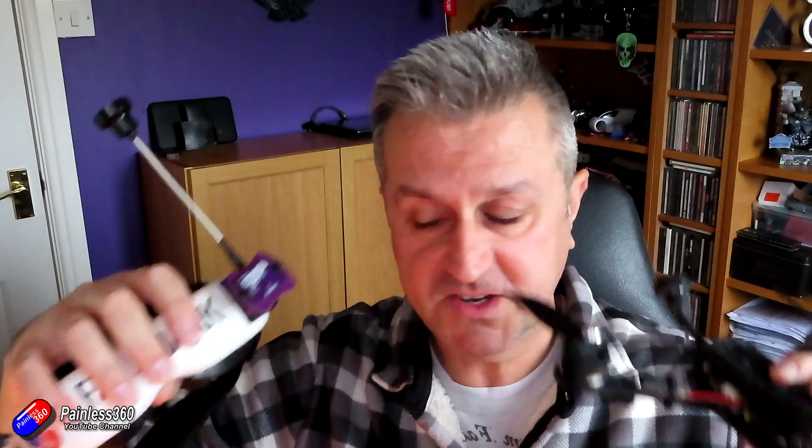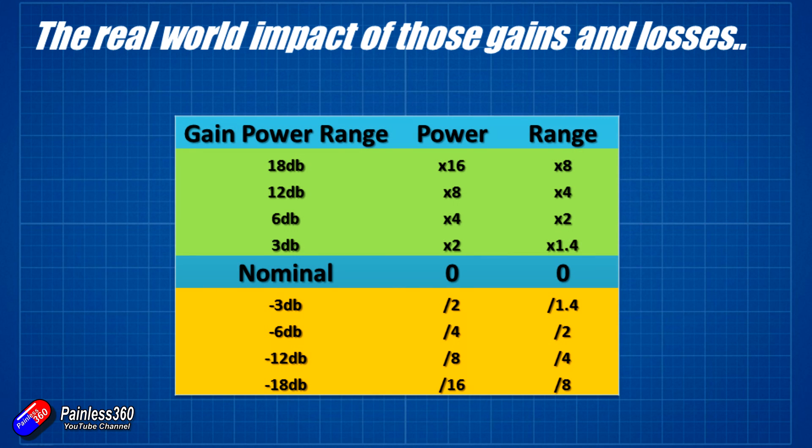Hopefully you're getting the idea that the power difference and the sensitivity difference, both measured in dB, can be added up. You can get further than twice the range if you have more than 6 dB. This data is from Menace RC — link down in the description. It's a great way to explain how it all works. For example, if you have twice the power, that's a change of 3 dB — so going from 25 to 50 milliwatts would only give you about 40% more range.